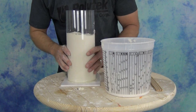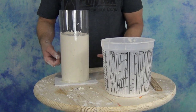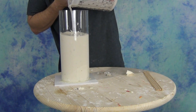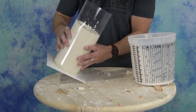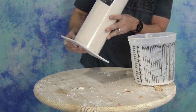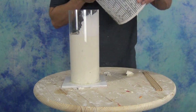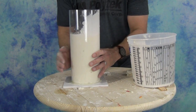One thing you want to be really careful about is remembering the position of the hand inside that alginate mold, because here we have fingers that are curled up and prone to trapping air bubbles. We want to minimize trapping air as much as possible by tilting the mold around and burping those air bubbles out of those fingertips. You can always write notes on the baseboard of foam core to keep track of exactly what that hand position is. Here we're filling it up about halfway and then tilting it over and shaking it a little bit to get those air bubbles out of the fingertips.